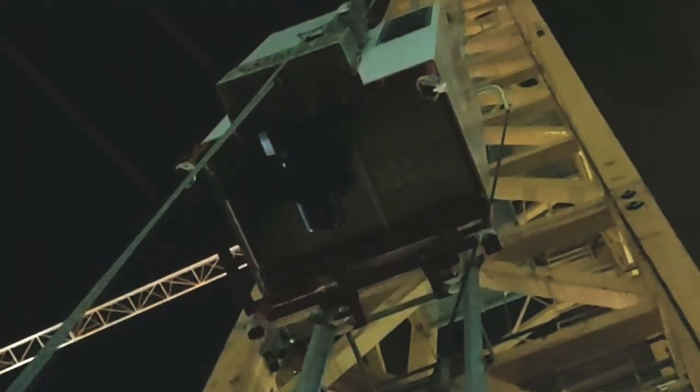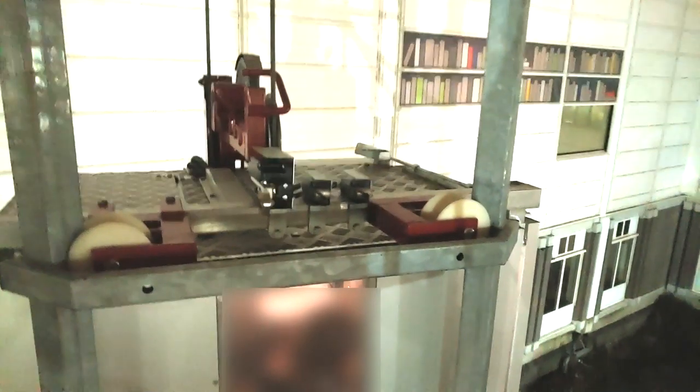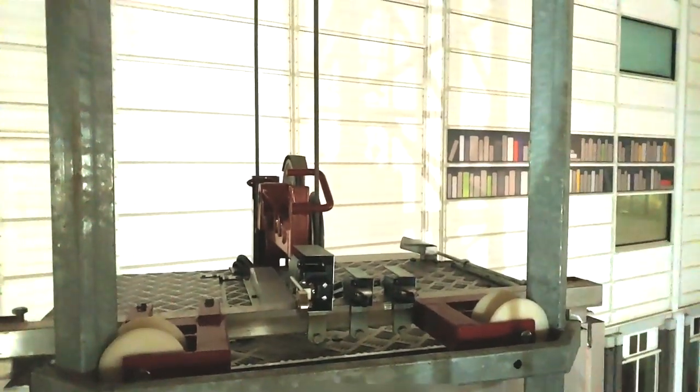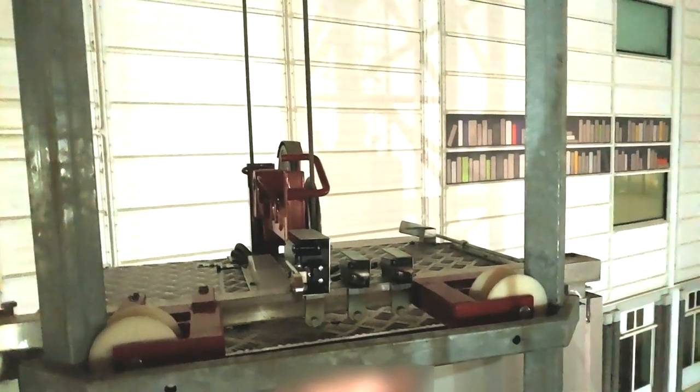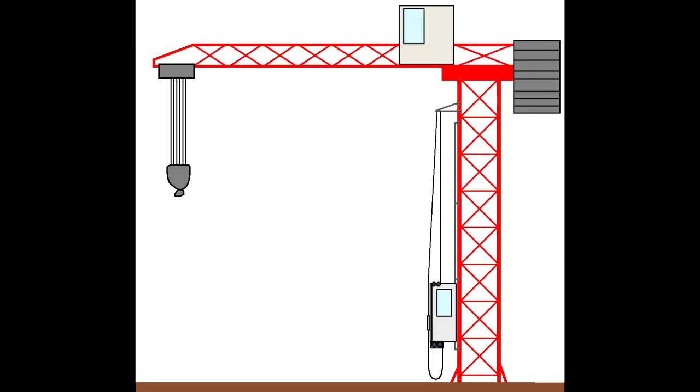There are just two cables on this lift. One of the cables goes and attaches to the lift itself. The other one goes behind the lift. So is it a secondary safety, which the lift locks onto to stop it falling if the main one snaps? Or is the second one just the other end of the first cable and does nothing? We literally do not know if this thing has safety gear or not, but it looks like it doesn't because we couldn't see any signs of it.